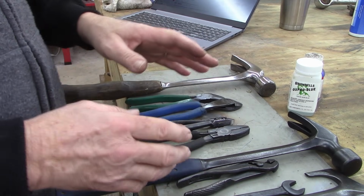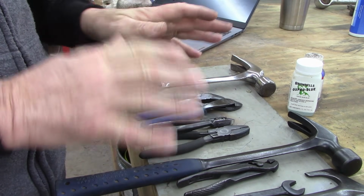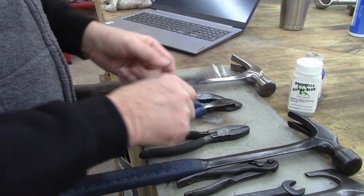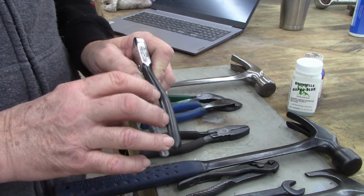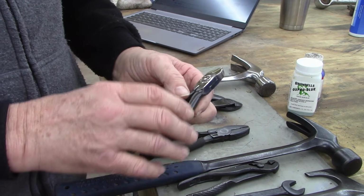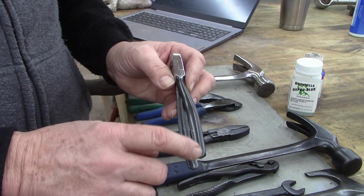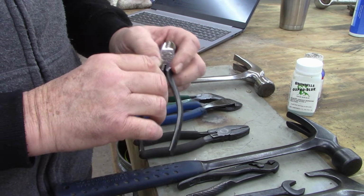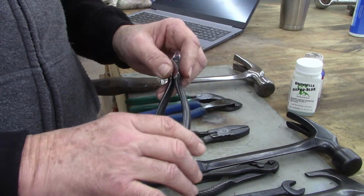There is a hot bluing. I have done that to a gun barrel before, and it's okay. It's a lot of steps. Now, I will say I am looking right now for a small convection oven. And during the summer here in Oklahoma, you can get 113, 114 degrees. And what I do is I coat these after I blued them with some waste oil and set them in the sun. And the acidic, I think it's the acidic in the oil darkens them, makes them blacker.